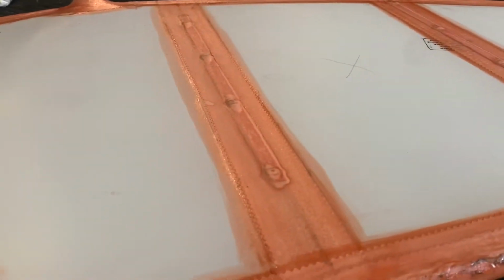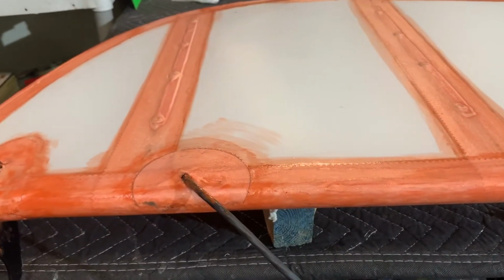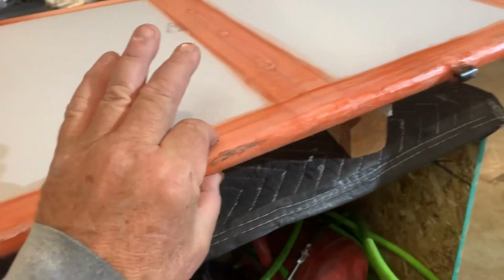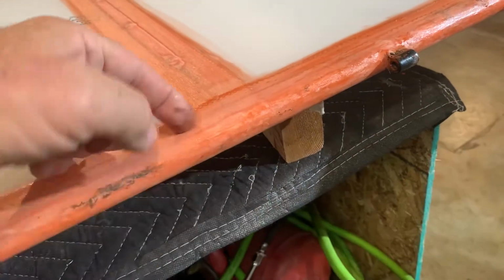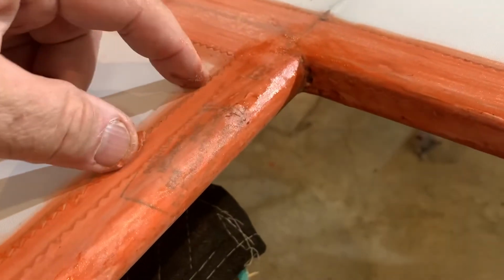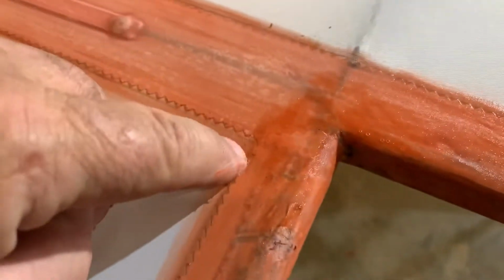And I really can't think of anything else. Hopefully that covers it. You can just see the order. I put the 2-inch tapes on. Then I put this over the top to cover all the joints here and to go across these 2-inch joints. And then I round this edge here that's on this side.